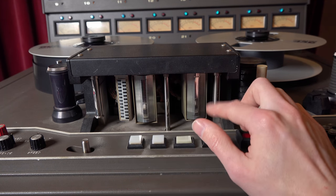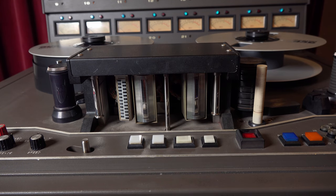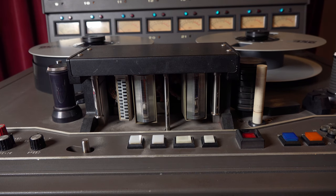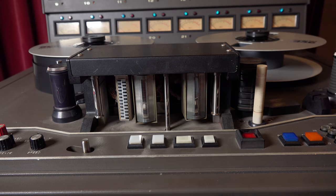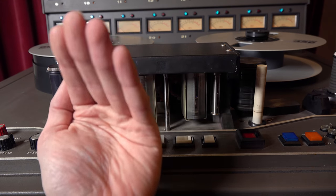The second issue: if you're recording on the record head and playing back on the playback head, there's an inherent time delay as tape travels between them — that throws musicians off. That's why the record head can also play back, so musicians monitor in real time. The quality is a bit limited since the coils are optimized for recording, not playback. The green 'cue' button on the auto locator selects monitoring through this record head.